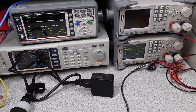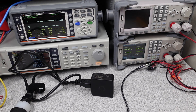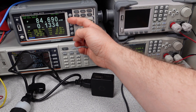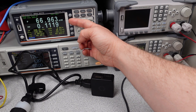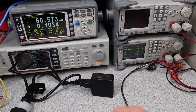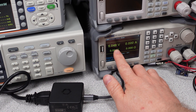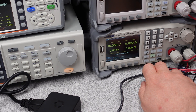This adapter also maintains very low noise while doing this. It has a claim of Department of Energy 6 efficiency — a mark indicating that power supplies meet a low enough idle power requirement and an efficiency level. This adapter blows away the requirement and is well under what is needed for idle power consumption; it will only use cents a year if left plugged in. The Framework power adapter has the normal modes of operation for a USB Power Delivery device: 5, 9, 15, and 20 volts for fixed output voltages. No 12-volt mode is available.